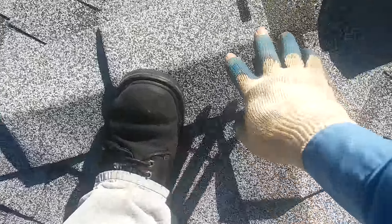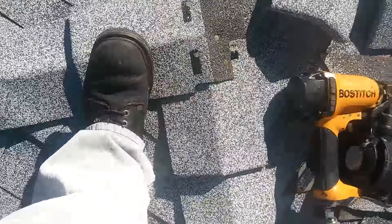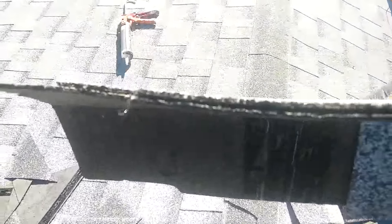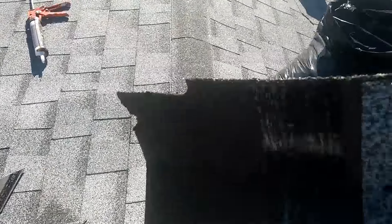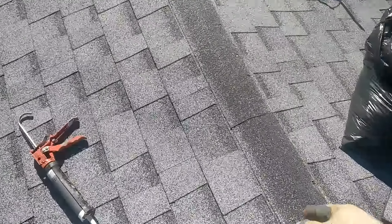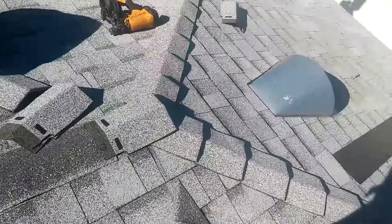When I get to the top of the hip, I just overlap on the other side and then this one is going to cover like this. This is not ridge glass - this is rapid ridge, so it's thicker. It has a double layer - the double layer is folded so it's four layers on top and it's very thick. To me it's better than ridge glass because ridge glass usually after five years it goes bad, but this is rapid ridge - it's a modified rapid ridge.